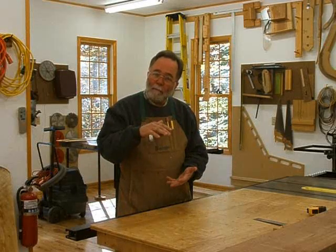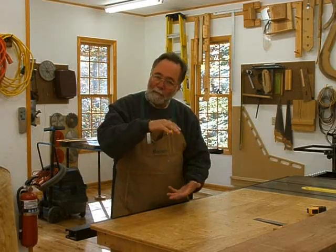You'll see some 2x10 material sticking out from the face of the stone. Those are the two braces that are going to actually hold the mantle. The mantle will actually fit with the top plank above the top of the 2x10 and the bottom plank below, just fit on there and rest in place.